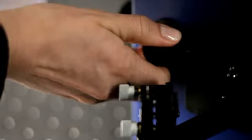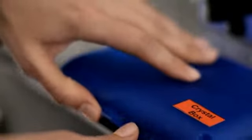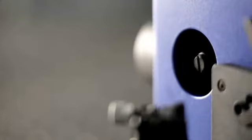Rather than ask you to open PulseCheck to do it, we created an opening. Just remove the cover, take the crystal for your specific range out of the box, and insert it into the slot. You'll feel the magnet pull on it. Turn the crystal until the pin snaps into place. Then replace the cover.